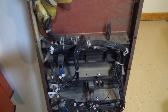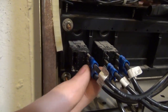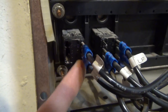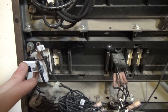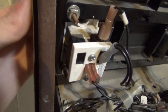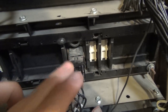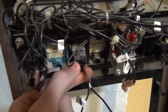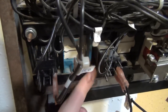That brings us down to the buttons. Up here on the key switches, these are the older style — old micro switches — and you can see how these are plugged in. This key switch only has one contact because there's only one position, and this one has two because we have two positions. Moving down, we can see the difference between the old and new type of button. We've got the new one with little hammers that come down and hit the switches, and the old one where the entire thing is just one unit.